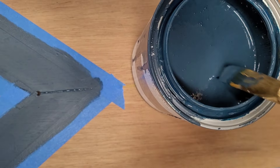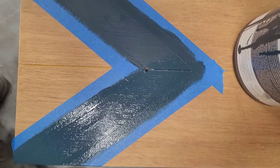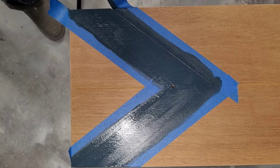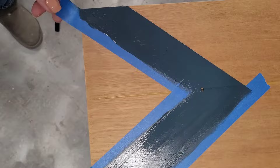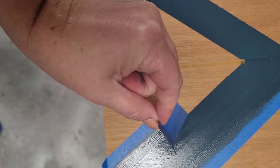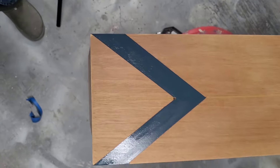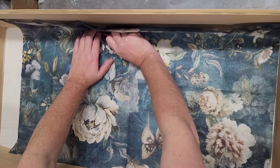Because I want to paint perfect stripes, I'm going to paint over the edges of my painter's tape using some clear coat. That's going to allow any bleed-through that goes under the tape to be in the clear coat, and then when I pull that off with my paint I'll get nice clean stripes. I'm putting some Poseidon over that area — I did end up needing two coats. I'm just brushing on the Poseidon using an artist brush since this is a small area. One Hour Enamel can also be brushed as well as sprayed — it brushes remarkably easily. You can see how adding clear coat to the edges of the tape gives perfectly straight lines even over the wood grain.